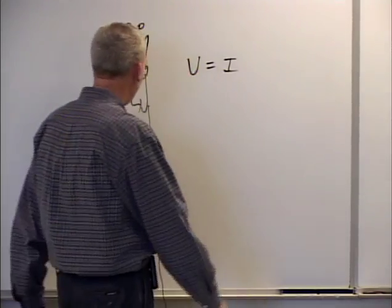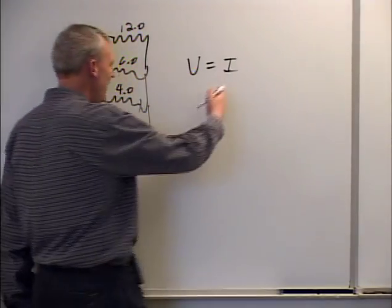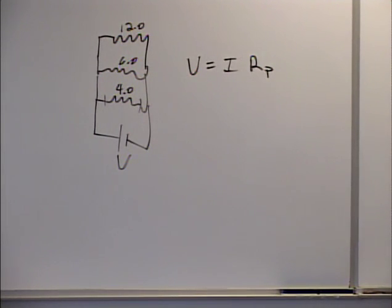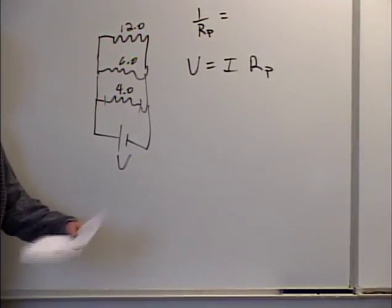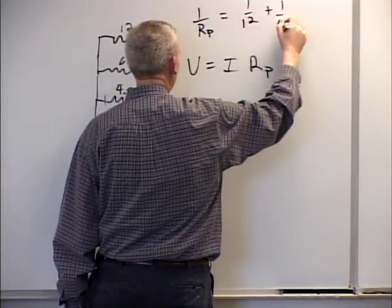Oh, yeah, they gave us the current. Thank you. Okay, so V equals I times R parallel. Now, what a lot of you did wrong, and I knew this was going to happen: you went, oh, it's 1 over RP, but you didn't say 1 over RP. You just said RP equals 1 over 12 plus 1 over 6 plus 1 over 4.